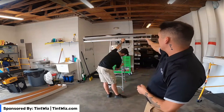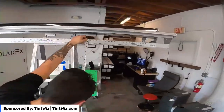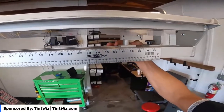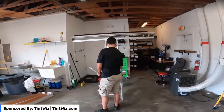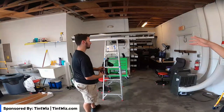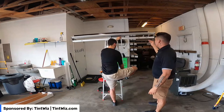The film handler has a measuring tape right here, and there's a cutter tab — you mark it up with the measurement and lock it in. This first cut is going to be 31 by 68. The actual measurement of the glass — we give ourselves an inch buffer on each side, so the actual measurement is probably 67 by 30. We cut an inch longer on both ends because that gives us a half-inch wiggle room. You don't want to cut it exactly because not every window is exactly square.